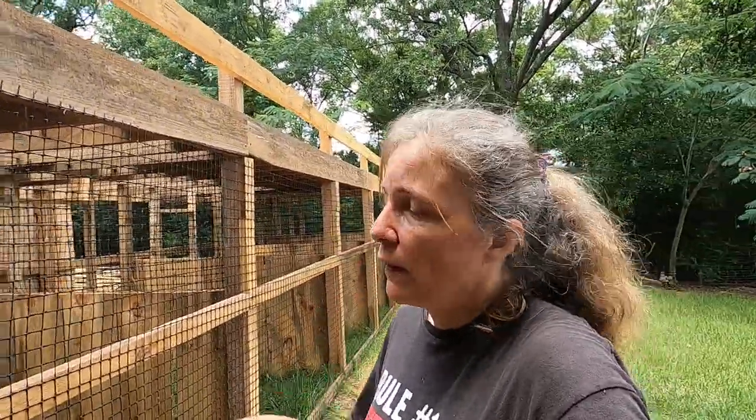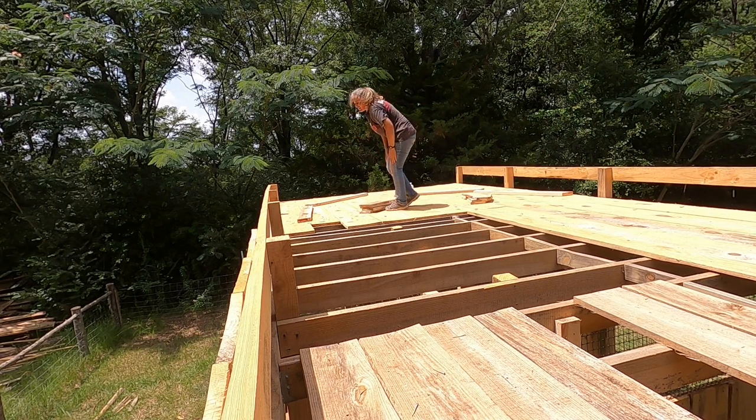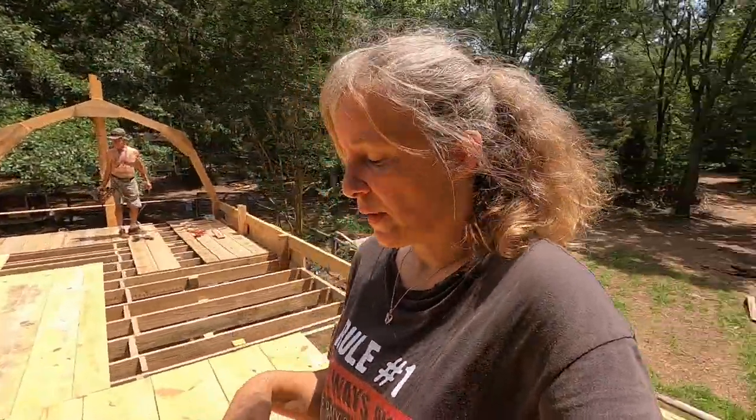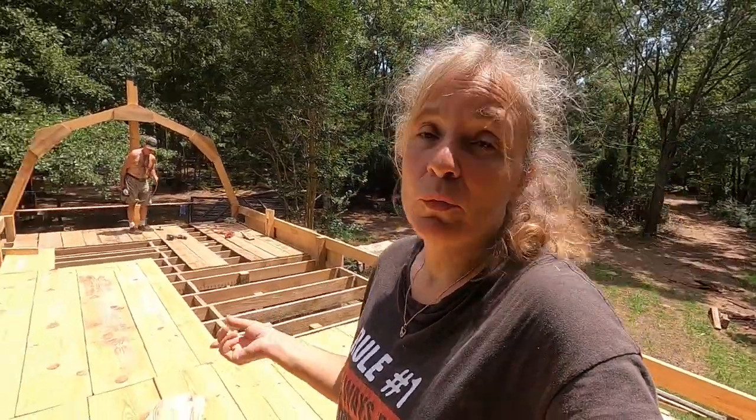For now I think we're going to work on rafters. We're ready to try to put one of these rafters together, and we're doing it up here on the second floor in the sun, because we actually have a flat surface up here. Down on the ground we don't have anything flat, so we're up here in the sun with a black shirt on. We're going to try to build this one rafter — I don't have enough gusset plates cut to do more than one, and we have to go to the store and get some lag bolts. So we're just going to put this one together and try to set it where it goes before we go to town and get some hardware.